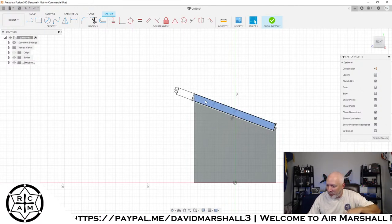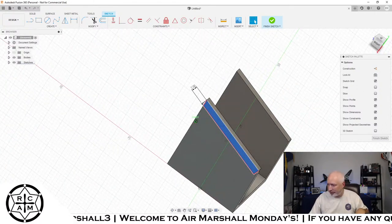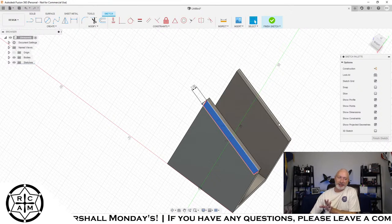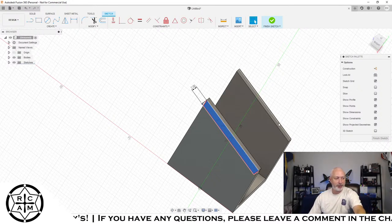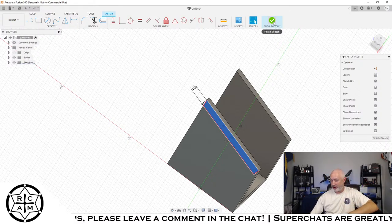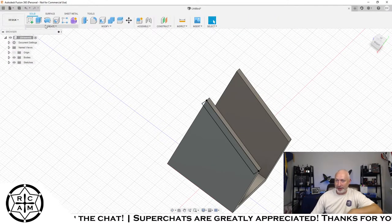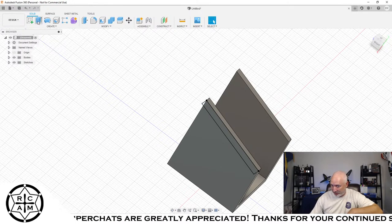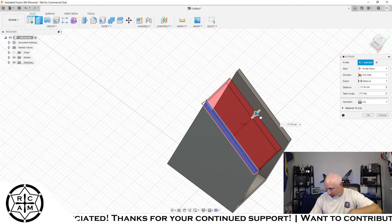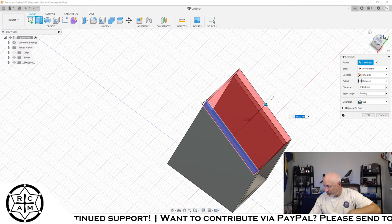So we're gonna do something a little weird here, but it's okay. It will work. It's kind of cheating, but it'll be all right. So what I want to do is I want this to be the surface that I mount the top of my SMA connector to for the antenna. I hate doing it because it's kind of cheap, and I would like it to look better than this, but it's okay. We're gonna extrude that across, and we're actually gonna, hold on.